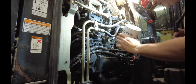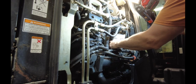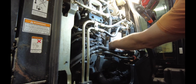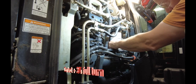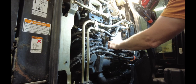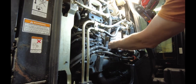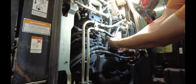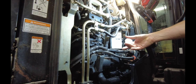This is the rear one. We've got our oil on the seal. I'm going to try to get some of that wire harness out of the way. This is three quarters of a turn after it makes contact. The other one had 20 newton meters — this one's just three quarters of a turn. Go ahead and get that oil water separator put on there. So that was fun doing the oil filters and the fuel filters.